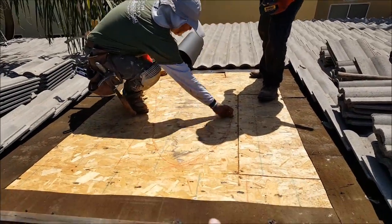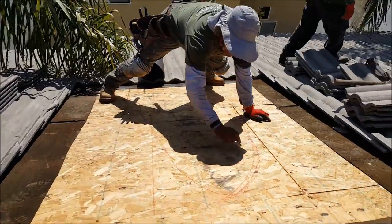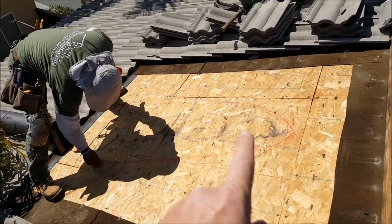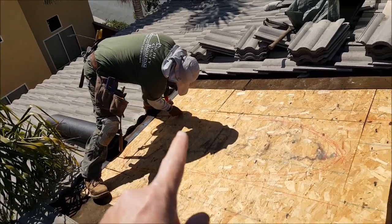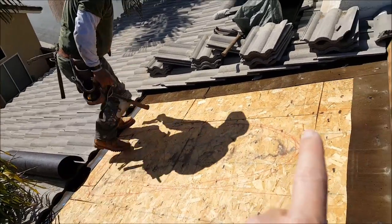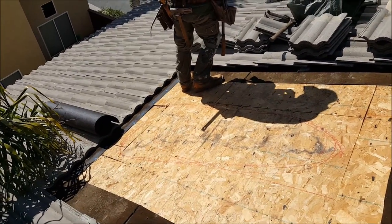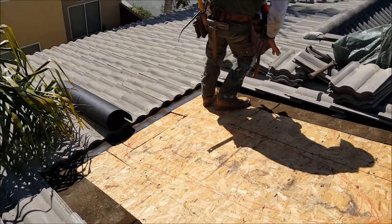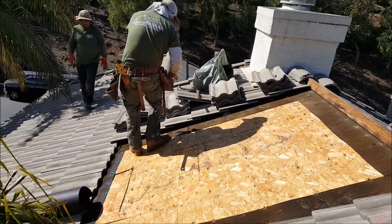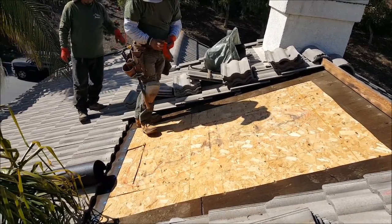Here's what you should do to make sure the roofer got the area: always have him circle the roof leak so he can show you what it is — find it and circle it. You can see all the water damage is confined in this area and on the outside nothing but clean plywood, which means it's contained. Started right here, fell into his house right there, circled all the way around it. That's how you know they actually did the leak detection and found the leak. Otherwise if they just cover up an area, how do you know? So make sure your roofer circles the leak.